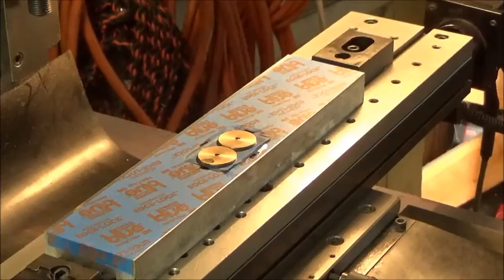The 2 small pieces have been mounted to the mill. Again, they're 3/4 of an inch in diameter, and about 50 thousandths of an inch thick. We're going to attempt to cut 2 pallet nib retainers out of these. There are two items that we need to make. They're both 3/16 of an inch by 3/8 of an inch, each with 2 clearance holes for a number 1 72 machine screw. Very teeny tiny little machine screw.